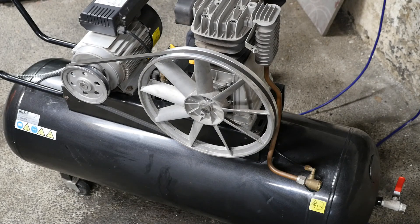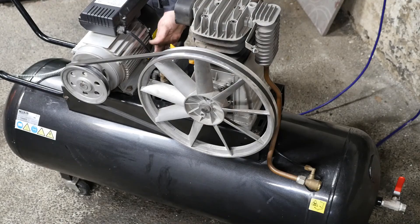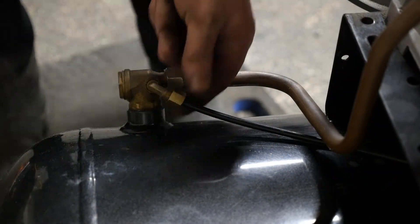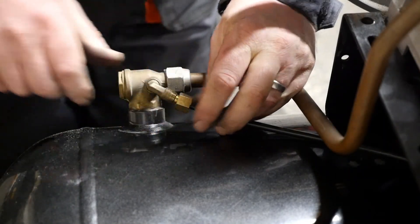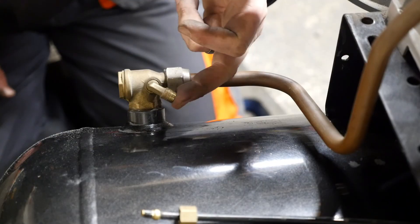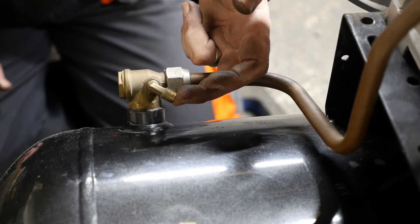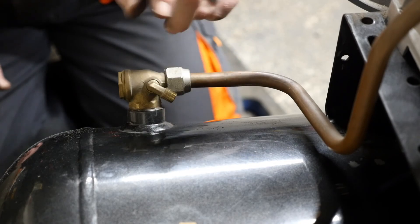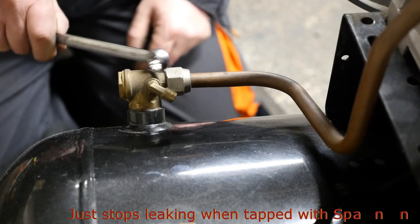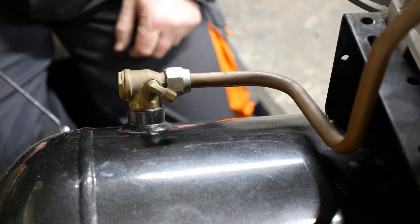Until I came to switch it off, and then I had permanent air leaking from the valve of the pressure switch. So now my attention is definitely on that brass junction piece — something's going on inside it, there must be a valve in there. I'm going to disconnect this pipe that leads to the pressure switch, and yes, that's where the air is leaking from — coming straight out of the air tank. Presumably there's a one-way valve in there, so as the compressor forces air into the tank there's a valve that cuts it back off.